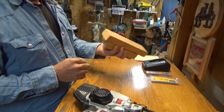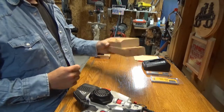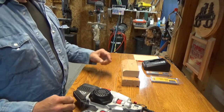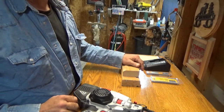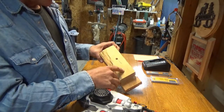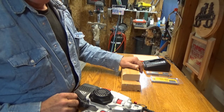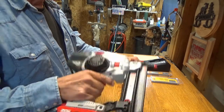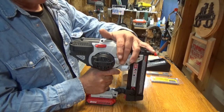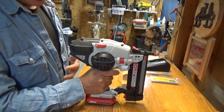This is actually redwood, not regular pine, and it makes a pretty good connection. I've been using it for a lot of fine stuff — frames and things like that — using the shorter brads, and I haven't had any problems. I haven't had any issues where it left marks on the wood or split anything because it was too powerful; I think the power is just right. With the depth adjustment you can sink it below the wood, but I have mine adjusted to keep it as flush with the wood as I can, and it's been pretty accurate.